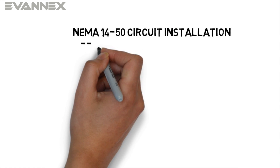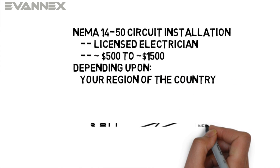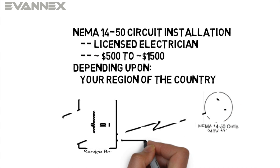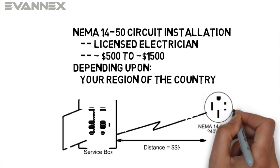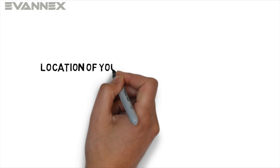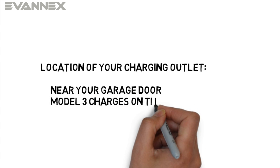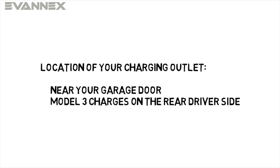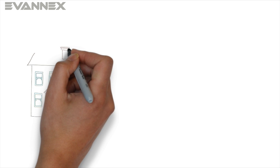It's likely that right now your residence doesn't have a NEMA 14-50 circuit, so you're going to have to have one installed. That's a job for a licensed electrician, and it will typically cost you between $500 and $1,500. Cost depends on installation rates in your part of the country, the distance between your charging outlet and your electrical service box, and the general complexity of the install itself. It's a good idea to get a couple of quotes. It's also important to think about the location of your charging outlet — it should be close to your garage door, if you have a garage, so you can use the outlet to charge a car that sits outside in your driveway. The Model 3 charging port sits on the rear driver's side of the car, so positioning your outlet should consider that. By the way, the Tesla charging cable is about 20 feet long, and if you need more length, you can purchase an extension cable.